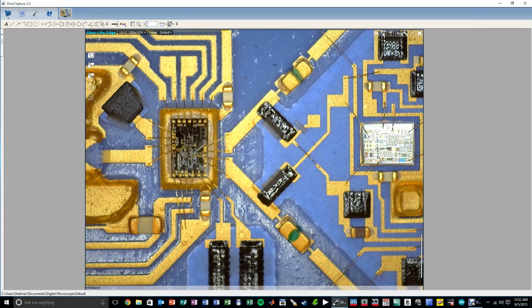And looking at this, again, I can't see the detail. It doesn't look like it's a distributed amplifier. I would have loved to see what's going on in here. But again, making a 25 gigahertz amplifier is really quite trivial now. It's not very difficult. But of course here they have an advantage of having very low noise and very high breakdown from the indium phosphide devices here. So that's definitely an advantage, which is why they've chosen to go in this direction.